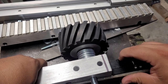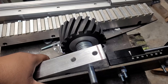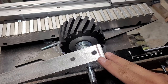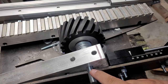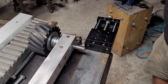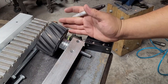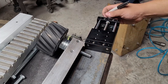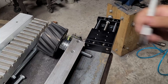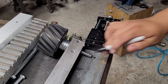I'm going to grind three-eighths off the front of the tooling arm — that gives me the eighth I'm missing plus another quarter-inch overlap. I can just take it to the 2x72 and press it against a 36-grit belt to grind it down. If you don't want this problem, get a six-inch wheel; if you have the tools get a four-inch — they're cheaper. Or if you're making your own tooling arm, account for that distance when using a four-inch wheel. After grinding, it goes past by about an eighth to three-sixteenths, which should be plenty.